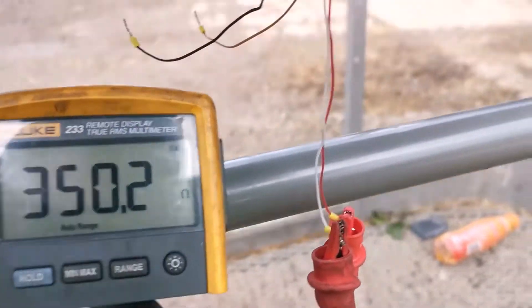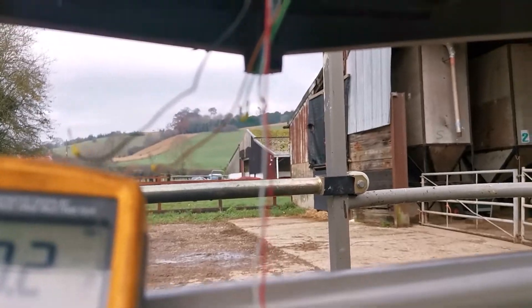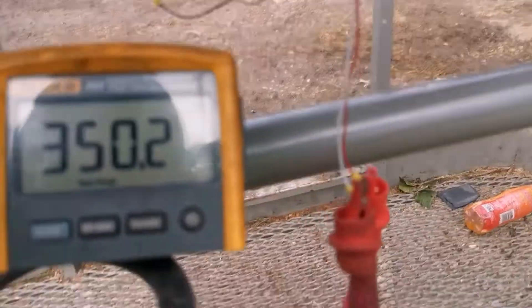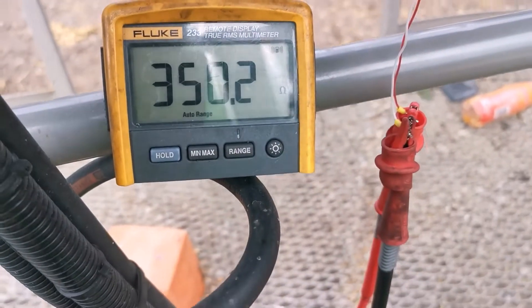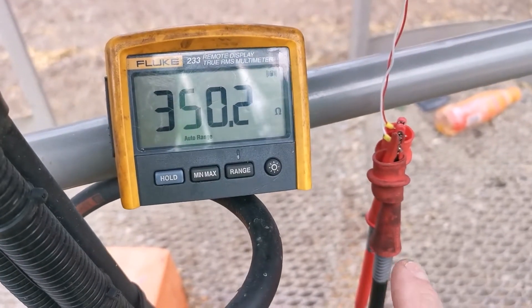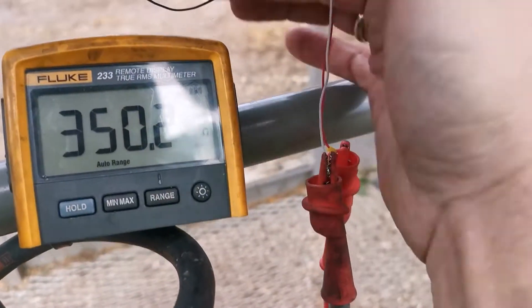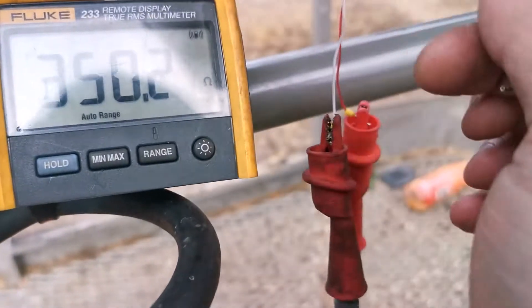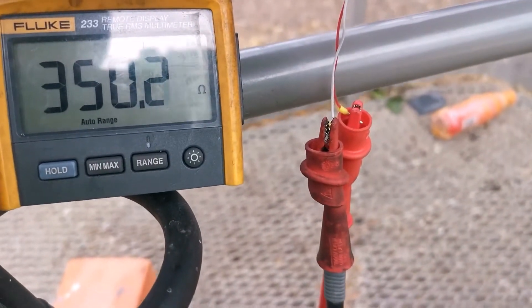So there's no problems with that. So what is important to do when you measure resistance - it is very important to disconnect the wires from the board, because the board can affect the reading. So you just want to purely measure resistance of the load cell itself. So we're just measuring the wires from the load cell directly - they're not connected, none of them are connected into the board. So output resistance is good.